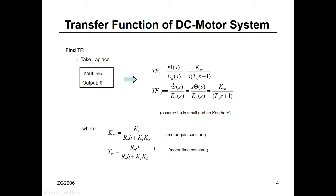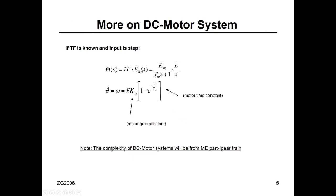That's all for the DC motor. You will need it if you want to design a controller for a DC motor. The solution is the transfer function multiplied by the input — usually a step function for positioning a robot, whose Laplace transform is E over S. When modeling the DC motor, the added complexity comes from including a gear ratio. This is a good problem for control systems. This is the end of Chapter 6. Thank you.